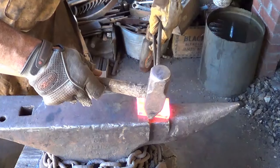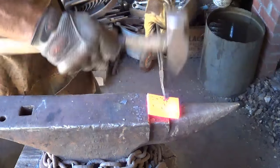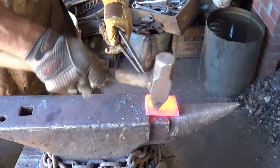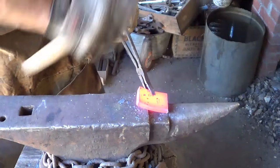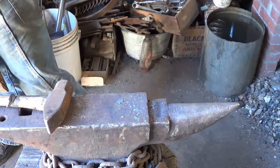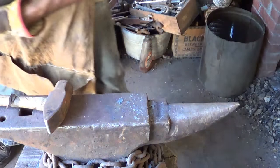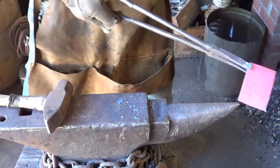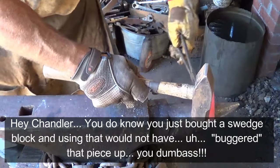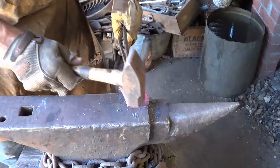This piece is hot — we're going to get her centered up right about in here so I put the curve on that. Just enough to match. Turn it around so we're doing the same on the other side. In reality, you should probably be making one of these for each pan, trying to kind of match the curve of the pan and be relatively flat. I think I'm okay with what I have, except the edge of this angle kind of buggered this thing out — so let's clean up those rough spots. I certainly don't want to be transferring score marks onto my pan.